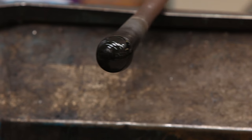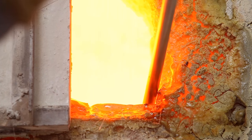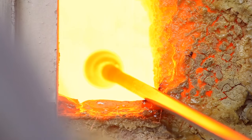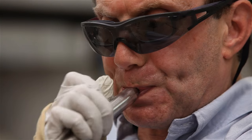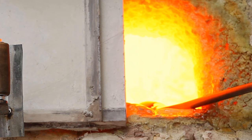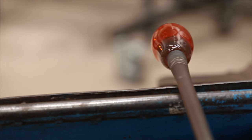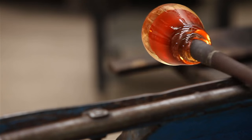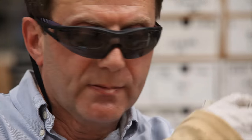At that stage, you then shape it, and as it cools down sufficiently, you gather another layer of clear glass over the surface and take it back to the bench. Cool it on the outside with a wooden block, shape it with a pad of wet newspaper by hand, and start to inflate it. To make a larger piece, you then get another gather of clear glass and go through that stage again. The next stage is to blow the bubble up and shape it.